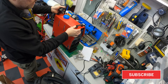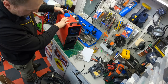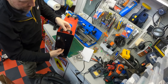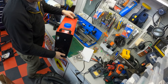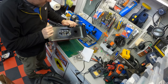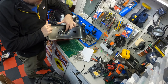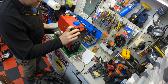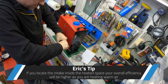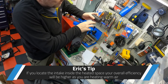What we got is our diesel heater. It's got an on-board reservoir, five liters-ish. Here's our hot air out. Cool room air in is back here and our inlet and our exhaust are down here. I've watched just about every video there is on these things lately and they're pretty cool. Exhaust here, inlet here, a small little inlet strainer. There is actually a screen in there to keep bugs and stuff from getting in.